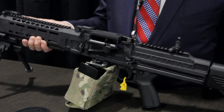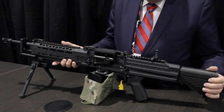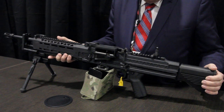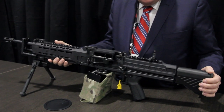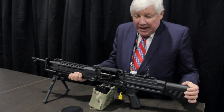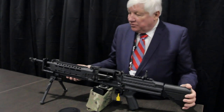So with this light of a gun, it should recoil more than most other machine guns, but actually because of the system and the long stroke, we get two advantages. One is the gun runs at a cycle rate of about 575 cycles per minute, and it also has no impact of the bolt carrier at the back of the receiver.